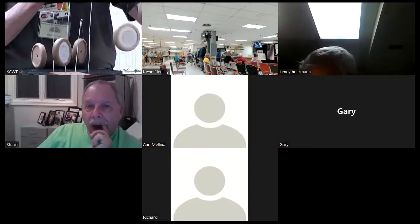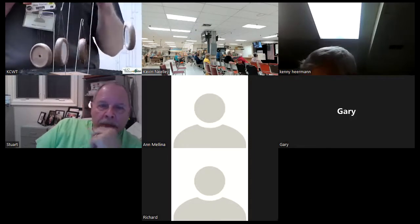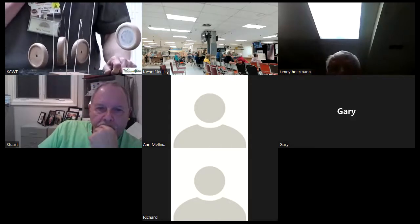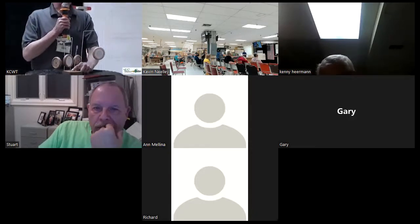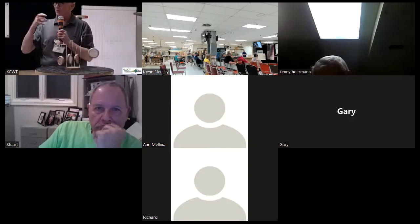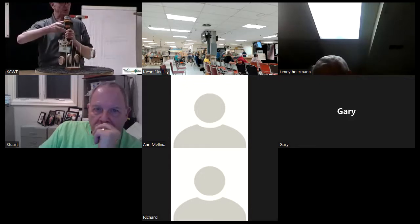And so anyway, they were fun to do. What I started off doing, actually, this is the base here, it's like the fifth one. I just took a 1x4 piece of cherry and cut it square, drilled a hole in it for the same size as my screw chuck. I thought that would be faster than trying to screw it onto a face plate. So I just screwed it on the screw chuck.